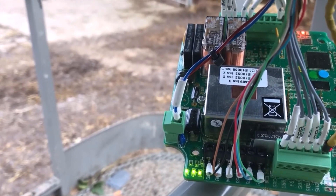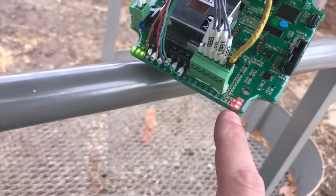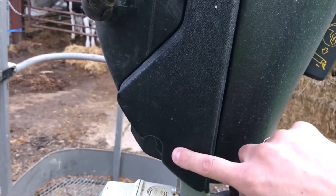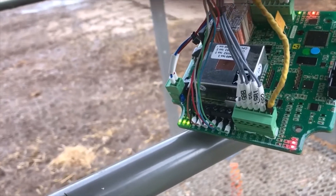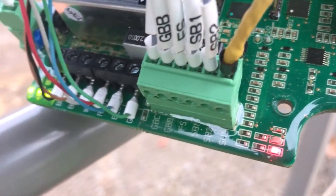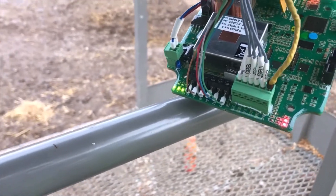So the next thing - on this corner you have two red LEDs. Those two red LEDs come in from SB1 and SB2 wires. SB1 and SB2 is showing those LEDs on, and SB1 and SB2 is going to be your SIOP system under the cover here - it's a proximity switch, and it comes into the board as SB1 or SB2 depending on which side. So if I pull this side of the console in, one of those LEDs should go off. See - the one gone off, I release it and it came back on. So those LEDs are not indicating any faults - they are just showing the SIOP system is on and everything is functioning as it should be.